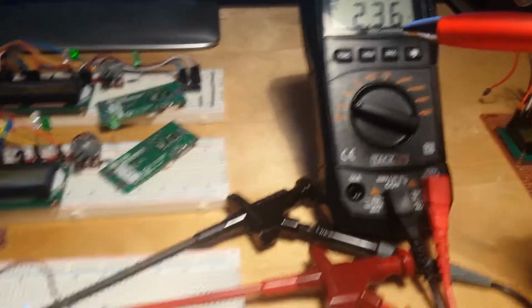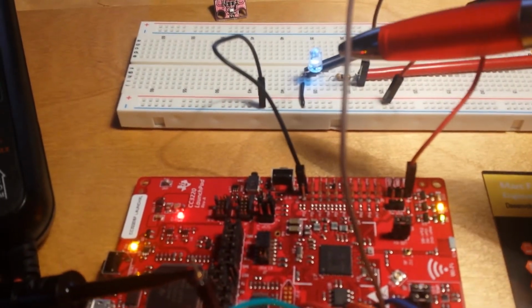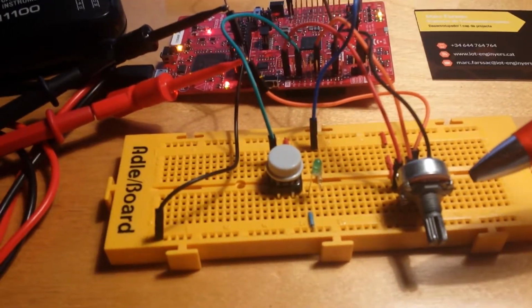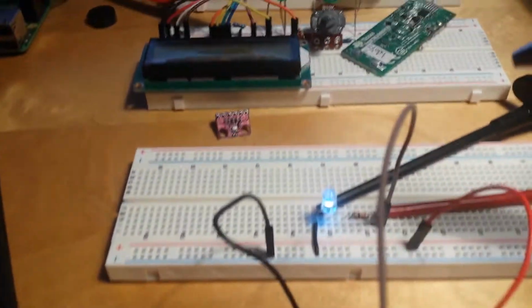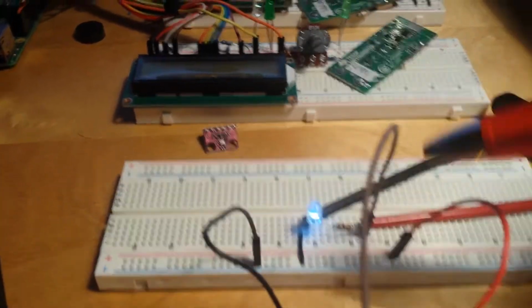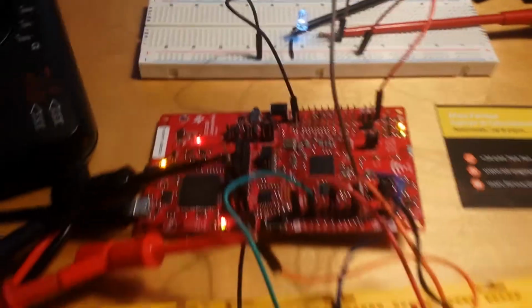This multimeter is connected to a pulse width modulated analog output, to which this LED is also connected. Since our analog input is converted to a digital value, we will have to calibrate it. Also, the conversion from the digital value read will have to be adjusted so the pulse width modulation can reproduce the initial voltage. We'll look later at the graphics and related analysis to understand this better.